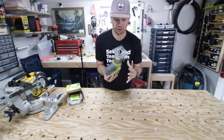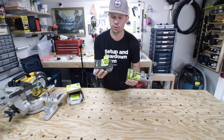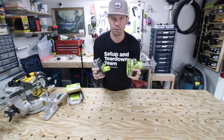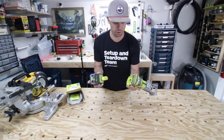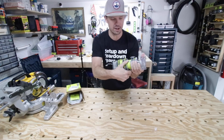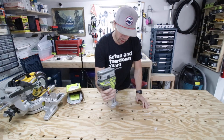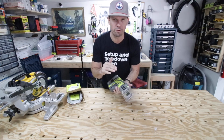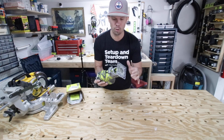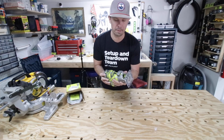After using it on the project, I'd say it's good, not great. Ryobi is still using stem batteries, but their tools are still really good, and putting it in doesn't off-balance the router at all — it actually feels a bit like gripping a reciprocating saw. It's still pretty light and I can do the work no problem. It doesn't quite have the power to go through hardwoods easily or run for a long period, but for plywood and softwoods it will be just fine.